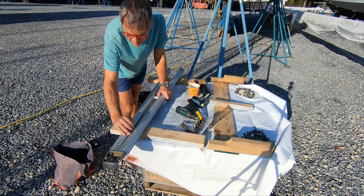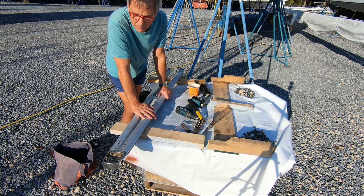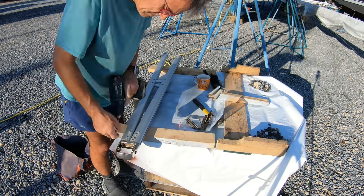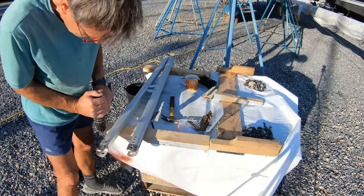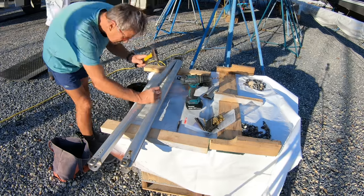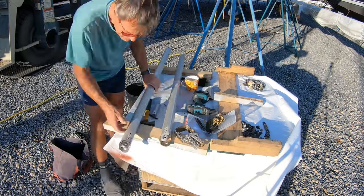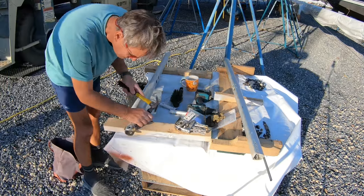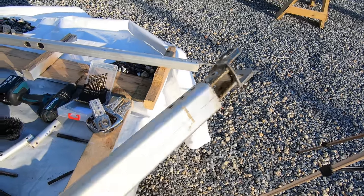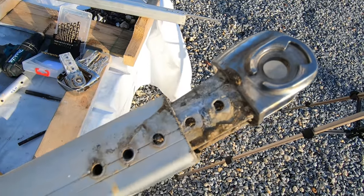Having got enthused rebuilding the two top spreaders, I'm taking the other spreaders apart. I'm going to put it on time-lapse so you can see me drilling out and getting them all apart. There were lots of rivets to drill out — I think it's going to take over 200 new rivets to get all three sets of spreaders back together again. As you can see, a fair bit of corrosion coming out. The aluminium powder is wet so they're coming out quite easily compared to the last ones, which were really brutal to get out. That's the middle spreaders done — now the lowers.